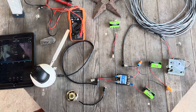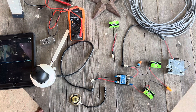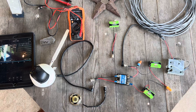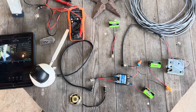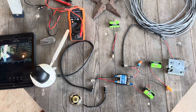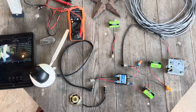A really important thing for all the audio mods is the custom sound on your camera. You'll have to turn the siren on, follow the prompts, and record a custom sound. You want something loud and long to get that voltage up enough to power your relay. The default sound is kind of an on-and-off tone, so you'll see the little light flicker here instead of being solid. Get your custom sound done — that's going to help you out a lot.